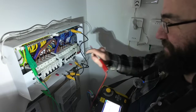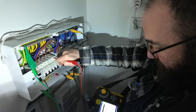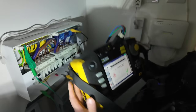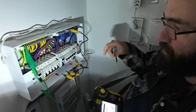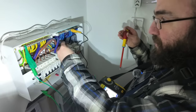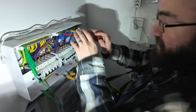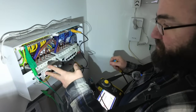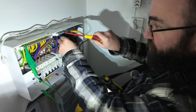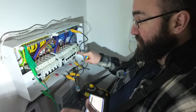Removing the first circuit's neutral from the bar and repeating the test — the reading went up to 2000 megohms, so we know that's not the offending circuit. This is the rinse-and-repeat process to find the problem. You can pull out the neutrals one at a time. The board must be turned off and isolated — you cannot be pulling neutrals out while anything is in circuit. If you pull the wrong neutral and the circuit is live, you'll have a live cable in your hand, so you have to make sure everything is off.